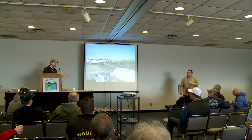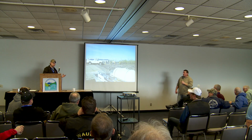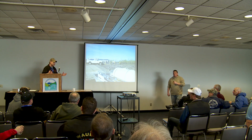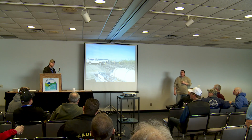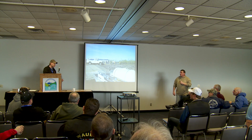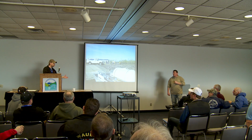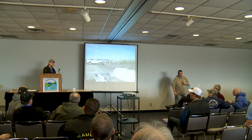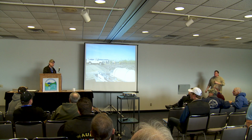So the first application would be a lot less strength, versus after maybe 2 years, you get down to the bottom of the tank, all of a sudden it's really high concentration alum. So when we order it now, it's the same every time, versus ordering 5,000 gallons, and now, when we'd add about 1,000 gallons at a crack. Well, we do 4 discharges, probably 2 additions, so you get maybe 3 years down the road sometimes. And it's got to stay heated. You can't let it freeze.